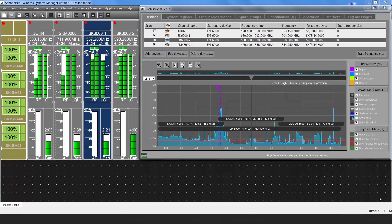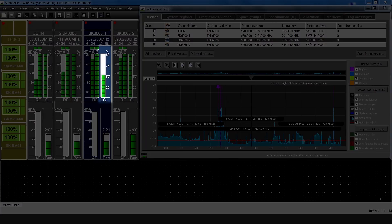LQI has four levels of quality. From 100% to 50%: no transmission errors — the audio quality is good enough to ensure 100%. From 49 to 20%: there are going to be short errors here; you might find the error correction is active and possibly one or two audio artifacts. From 19 to 1%: there are frequent errors — error correction is now active and you are going to have an increased risk of audio dropouts. At 0%: no transmission at all — dropouts are happening all the time and error correction is going into overdrive. We're not going to work in this situation.